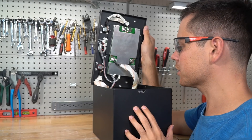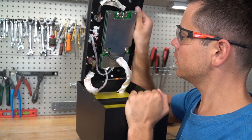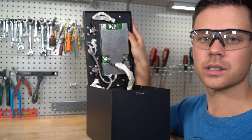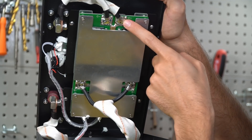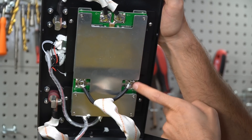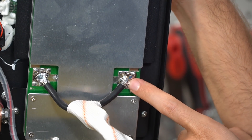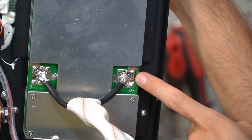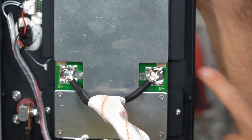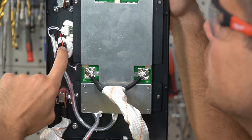This looks a little similar to the SOK battery — they even have the support bar going across the cells, the same terminals, and these covers. But this is a different BMS. Look at these solder joints on the BMS input and BMS output — we have globs of solder. Technically they reach the proper temperature, but I just do not like the look of that. I personally hate solder because you have to depend on someone's craftsmanship to ensure a solid connection. The switch for the BMS is glued into position — it's a little sloppy, but it will do the job.